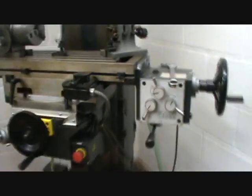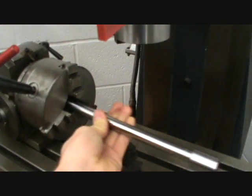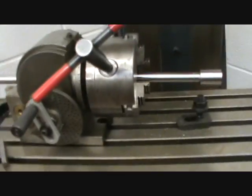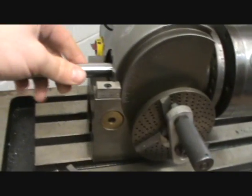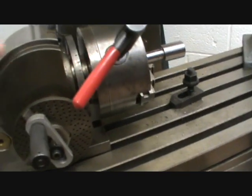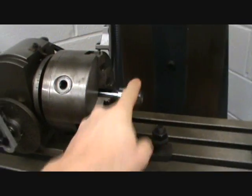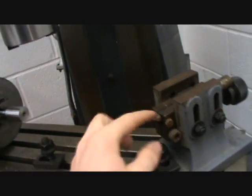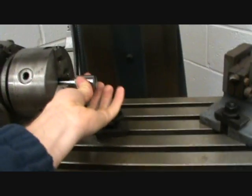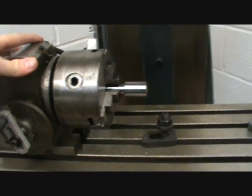What I'm going to do now is mount this drawbar which I have just threaded into the milling machine. This dividing head has a box with chuck on it which allows for a bigger drawbar to come through the spindle. Basically I'm going to put four flats on here using this dividing head. I might end up supporting it with the tailstock, it is reasonably rigid. I'll mount everything up, set the whole machine up, and then start recording.